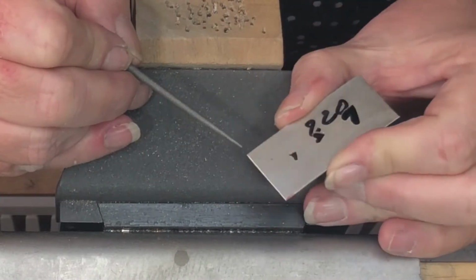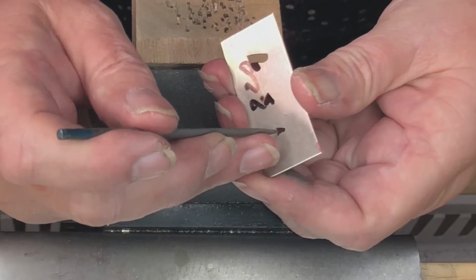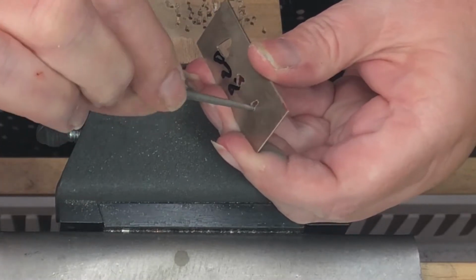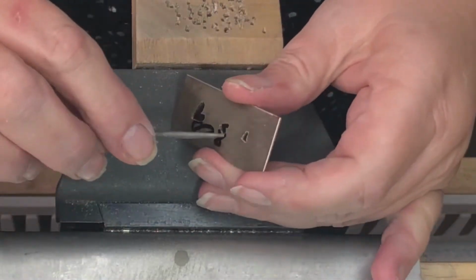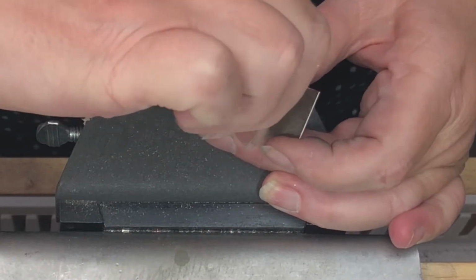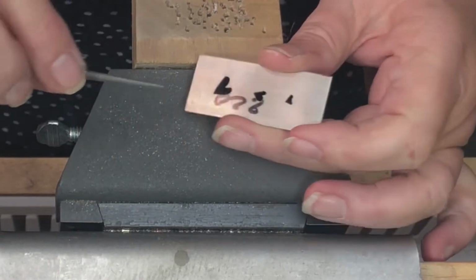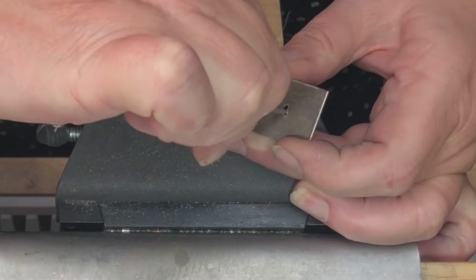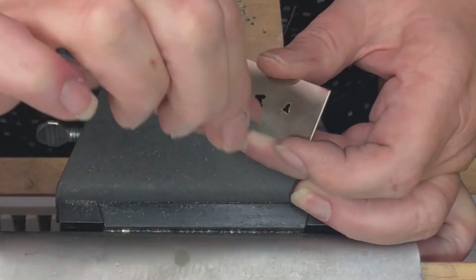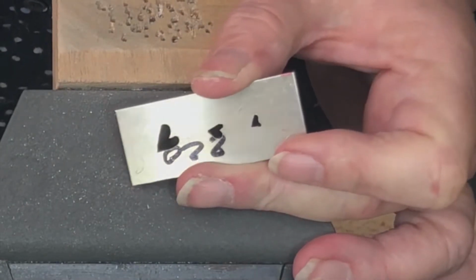obviously following my Sharpie didn't give me a perfect heart, but I can change that. Now I could go back in with my jeweler's saw and refine that, or I can just take my files. Now that's a really tiny little heart, so I'm just going to take the very tip of this and I'm going to ream out, just twisting it. I'm going to ream out that top part of that heart, and you can see how it's changing. And I'm pushing out to make it go out. I'm pushing in that direction and I'm twisting. And you can see how it's refining that heart shape.